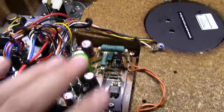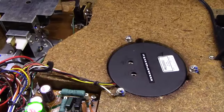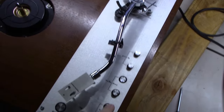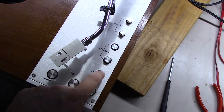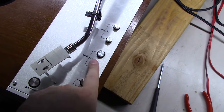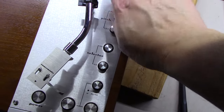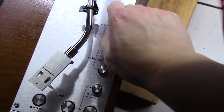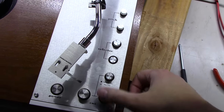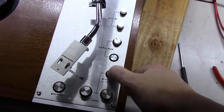Got it all recapped, got all the switches and pots cleaned at this point. We're going to flip it over and get this thing's bearing greased up. We've got it flipped back up and I continue to keep hitting buttons and turning pots because now they're upside down and more of the Deoxit liquid may flow around from a different angle down inside those buttons — so keep working the controls.